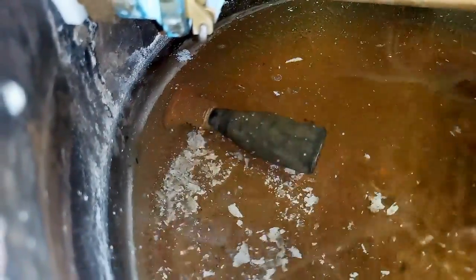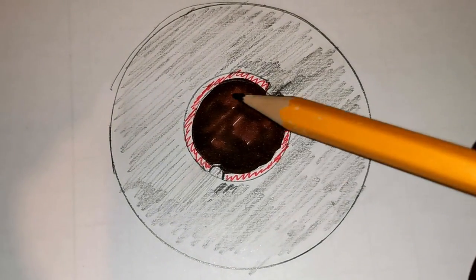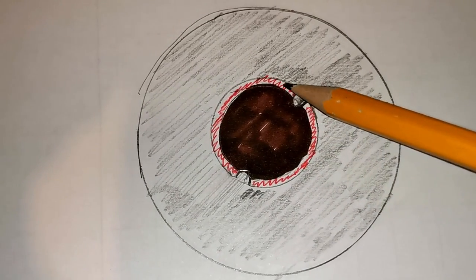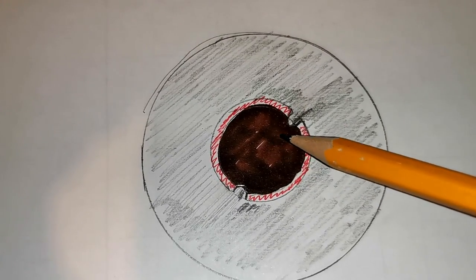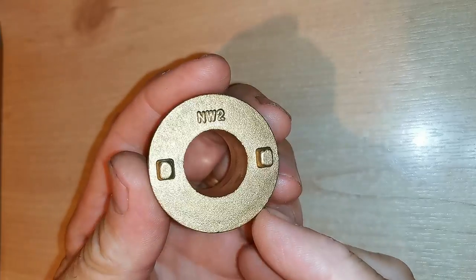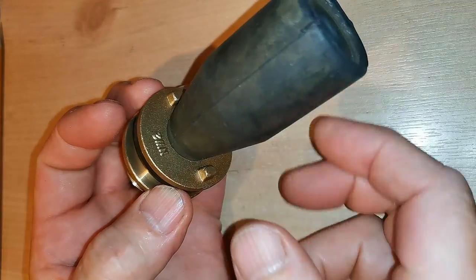Now this feed connection is a little different to some of the others I see — you can see it's got threads sticking out into the tank; they're usually flat up against the tank. An important note: sometimes loft tank connectors have little lugs that stick out into the pipe, so when you put your bung in you get a gap all the way around the outside and it's not going to seal off the tank — water will continuously dribble out whilst you're trying to do the job. Before you bung it off, put your finger inside the hole and make sure it is round with no little lugs sticking out. If you do find this type of connector, all you can do is use a rag or a hard bit of sponge and put that in the hole instead.